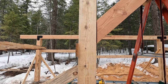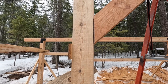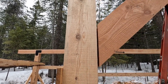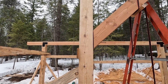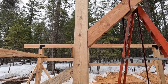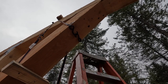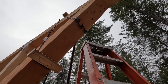We've been working on this other brace. The post isn't quite square to what we've got going on, so we're going to recut this joint to take out this quarter of an inch so it fits tight on the upper and lower end. It took a little bit of effort, but we ended up having to dig out those three structural screws I had buried. Anyway, we're making progress.